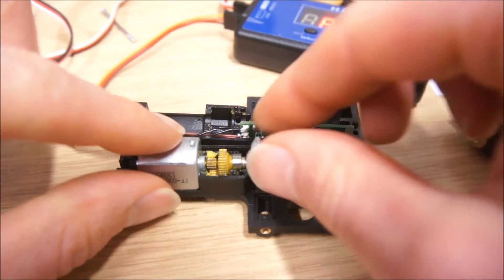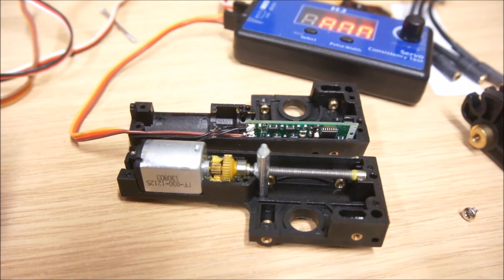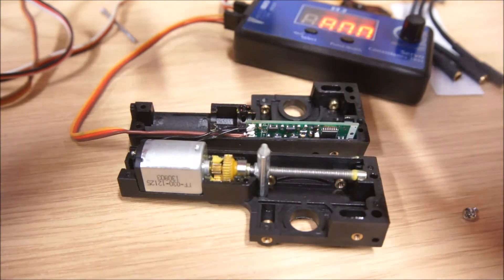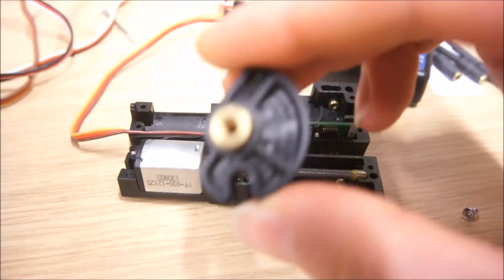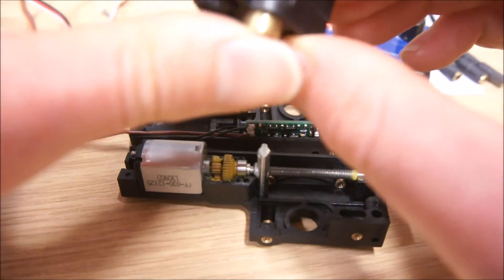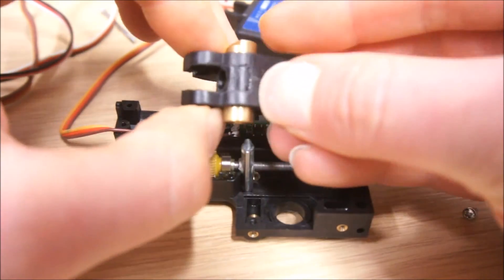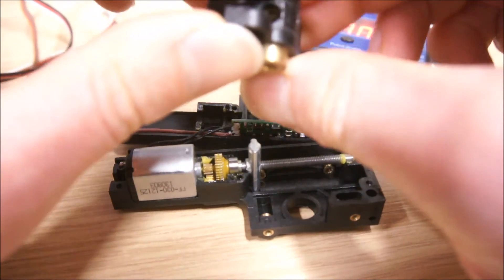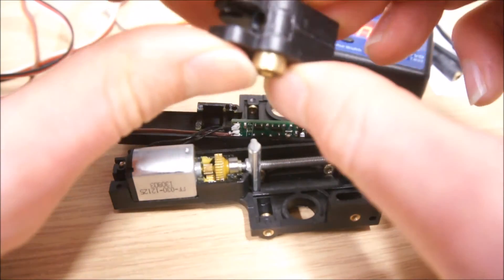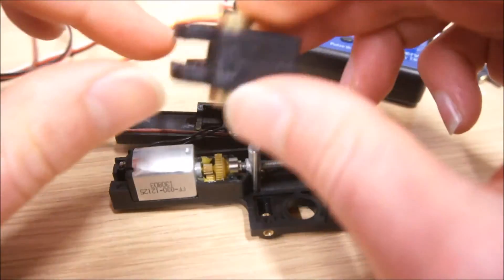Overall, that's as far as I'm comfortable taking it apart. It looks like a very nice, very solid device despite the plastic housing. There are also aluminum versions available if you want something even sturdier. The central shaft here seems to be brass — very solid — and it appears to be injection-molded into the piece. It's definitely very solid and could be used as a mounting point for higher loads than a few grams of aircraft landing gear.